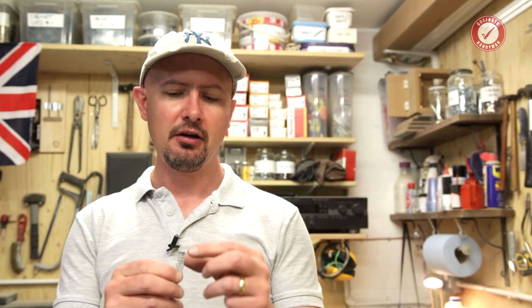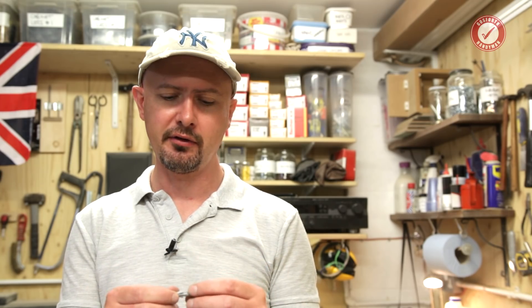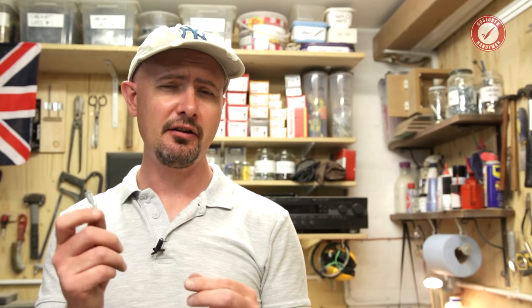I would never tend to hang anything with an axial force on these — they're just not really designed to handle those sort of forces. For shear forces, we know they can handle a much higher load. As per usual, don't go off my figures for anything proper that you're doing — go off the manufacturer's official specs. This is just a bit of fun to see what they can actually withstand. Post in the comments what your favourite lightweight plasterboard fitting is. This is my go-to for lightweight stuff in drywall — dead easy to use, relatively inexpensive, and I've used these for years without any problems. If there's a product you'd like to see me test on Test Tuesday, pop that in the comments too. See you next time — bye!